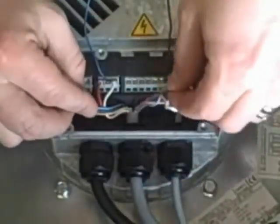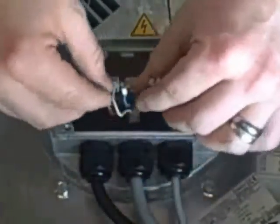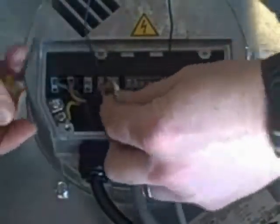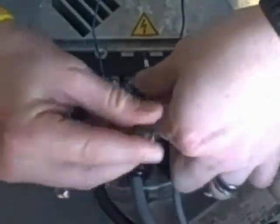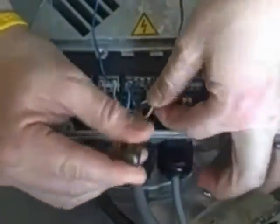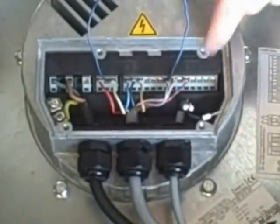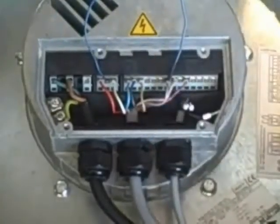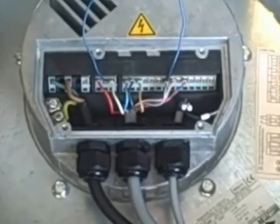You've got a red and blue wire — this is your ground wire going to your output section. You're left with brown, blue, and black, which go to your actual potentiometer on analog one. Blue goes to ground, black is your zero to ten input control, and brown is your control voltage of plus ten. Now all the wires are in place, with a jumper wire providing control voltage to the lights and failure alarms. The potentiometer is fully wired in. When power is on you'll hear a click and the fan will only go as high as the input voltage provided by the potentiometer.